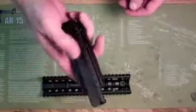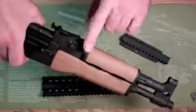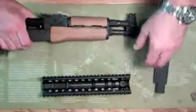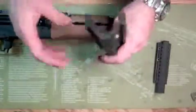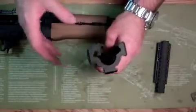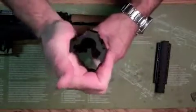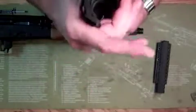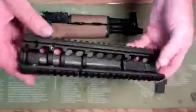This actually feels lighter than the original components. The original is all steel, and this being aluminum feels lighter than the original. But the rail itself is a little heavy. Obviously it not being a cylinder, it doesn't have the benefit of that tube. When you have external pressures applied to it, a cylinder can combat those forces a little bit better. So it only being a three-sided rail, they had to beef it up a little bit.